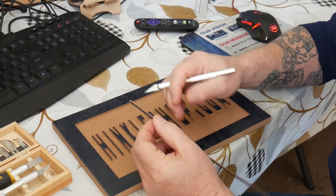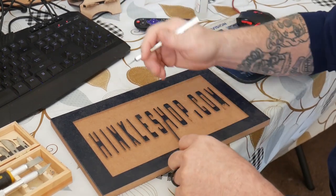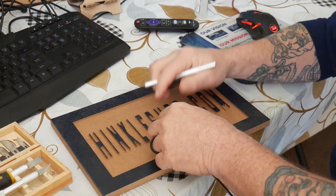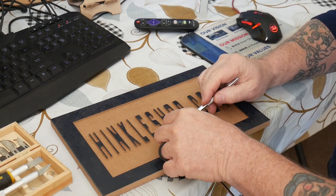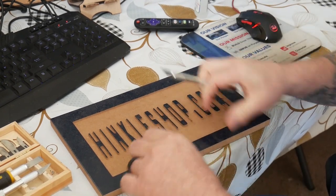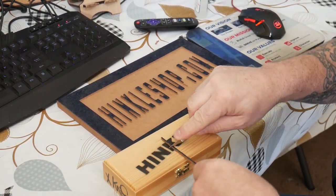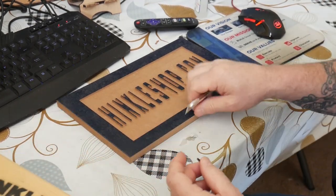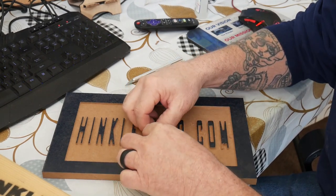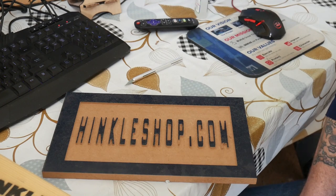We're going to take our repair piece and put it in here. Measure how long it needs to be. What I did was slice it an eighth of an inch tall and as close to this width as possible. We're going to put it in here. We're going to cut it off to that length. A little bit of pressure — I've marked it. I'm going to take some CA glue and put this piece on here. Maybe a little touch-up paint. You'll be in good shape.